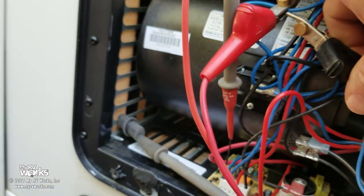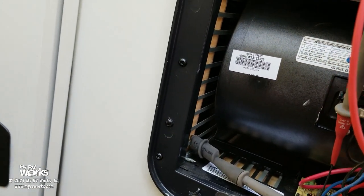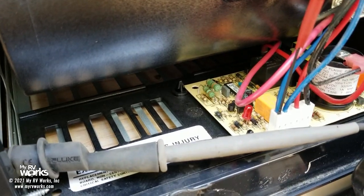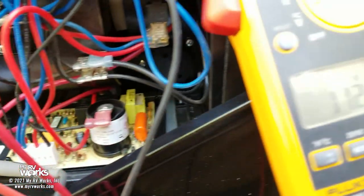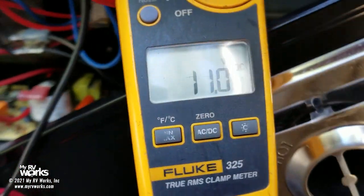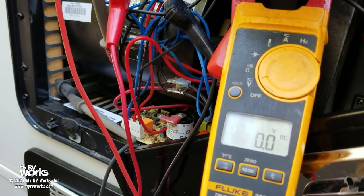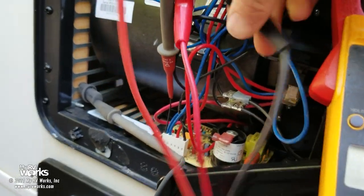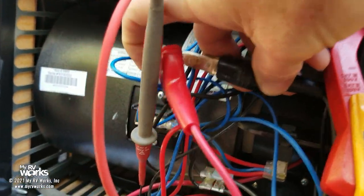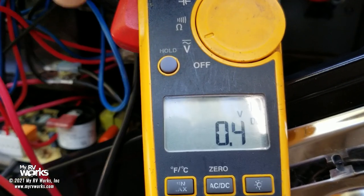The meter is set to voltage DC. The fan is in post-purge — it's thinking it's done. I'm going to take two hands and wedge this pin in there. There we go — he's wedged in and you can see it's touching. Now let's watch for that blink. This time I do have 12 volts, and there — our furnace started. That explains the intermittency.